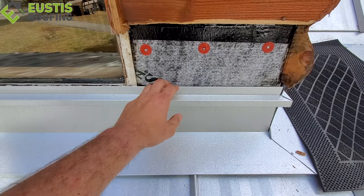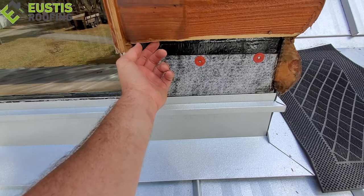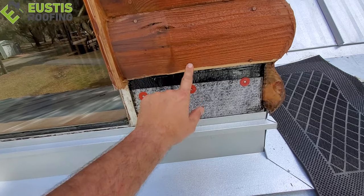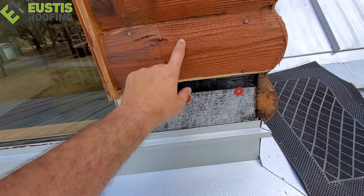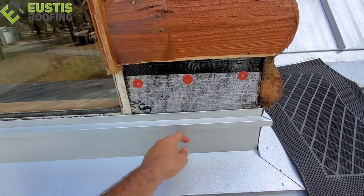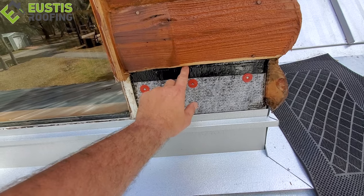Now this is what's crucial right here. See how we have this flange — we want this to go all the way up underneath here. So we're going to get underneath this wood and we're going to bring another piece of flashing over this so that if the water ever gets behind here, it'll come right back out. A lot of times there's leaks behind these on your house here, and then the water runs — it goes behind the flashing and goes inside. And you're going to call and say you've got a roof leak, when you actually have a leak in your dormer or up underneath.